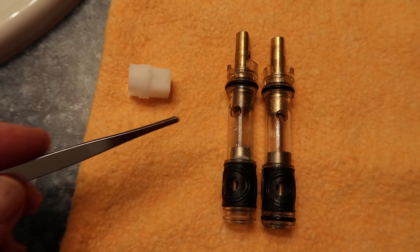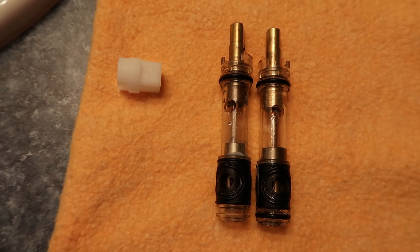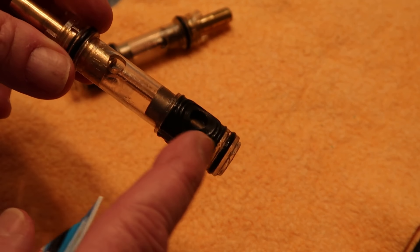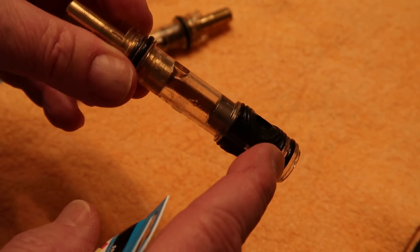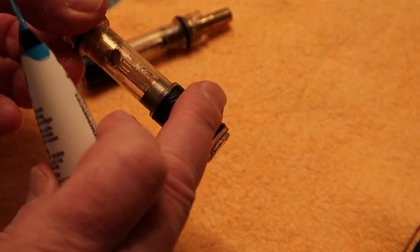I also curled up a paper towel and removed a little bit of mineral deposits and debris. So now it's nice and clean in there. You have to make sure that this is really clean because if you get debris in there the faucet is going to continue to leak. Now would be a good time to check and make sure you have the right cartridge — I was ready to put this in and I realized I had the wrong part. They looked exactly the same except this hole was in a different position. It would have fit but it wouldn't have worked. So make sure the hardware store is open before you tackle this project. Here's where the grease comes into play — I want to make sure this doesn't catch on any burrs or mineral deposits, so I'm going to put some silicone grease all over these rubber pieces.